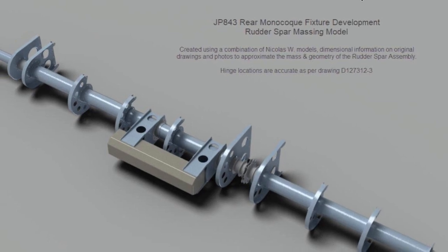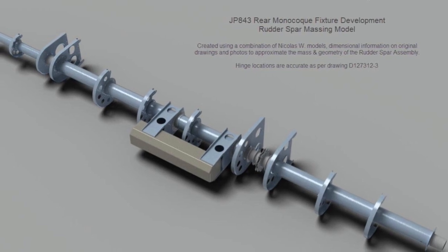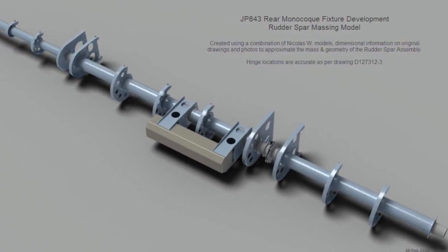We're finding those by systematically going in great detail on every one of these parts and pieces. The only way we can make corrections is to build 3D models. From the 3D models, we produce DXF toolpath files, reducing the amount of time required to actually manufacture parts and making it easier for the guys in the shop. What CAD does now is take all the available information, manipulate it, and make it work within the model itself. So you're eliminating things like the plaster masters — you may want to go to a master hinge tool or something like that, but basically the CAD determines all that for you. It's a huge labor saver for all the lofting and trigonometry that the guy in the shop would have to do to make even the simplest part.